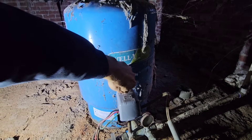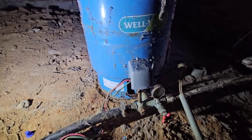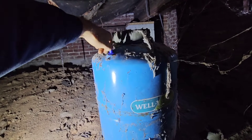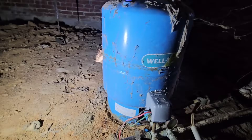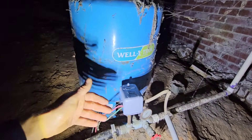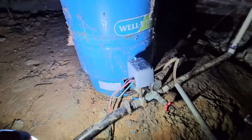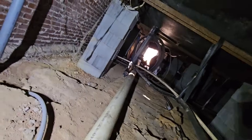There's no need to add that to the bill today — we're just going to let him use this until it dies. I'll explain to the homeowner exactly what to be on the lookout for if the tank dies. Basically, when you start noticing surging water in your house — most commonly people notice it in the shower or at the kitchen sink — that high-low fluctuation of pressure is your switch clicking on and off, your pump kicking on and off. That's due to the tank being waterlogged and the bladder being bad. If you ever notice that, replace your tank, or you'll be killing your pump within a matter of weeks.